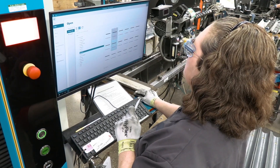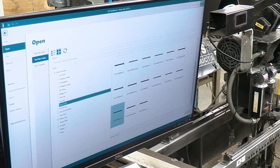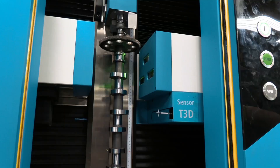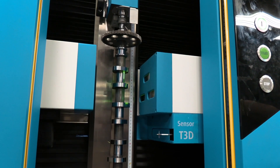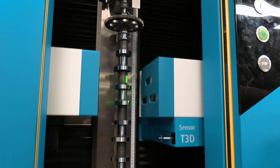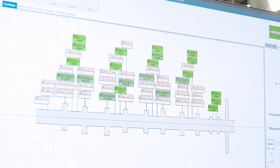How does the Opticline inspect the cam for Jasper specification? First of all, it's looking for information that we've programmed into our system. Then it uses six state-of-the-art cameras and lights that cast a shadow around the object. That gives us a go-no-go on our viewing screen.